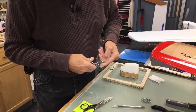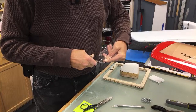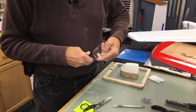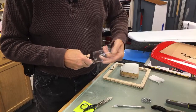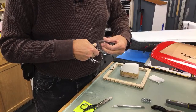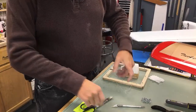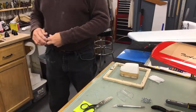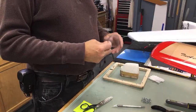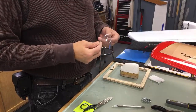Oh, yeah. That's why I couldn't believe those guys at Boeing couldn't pull that Horten 229 canopy. They wasted two big, thick pieces of half-inch thick Lexan, 4x8 sheets. You know, Boeing, money's no object. Sure, they've got a big giant autoclave there and all sorts of stuff. They pulled that piece, no frame. You can watch it on YouTube. They pulled it out of that autoclave on top of that plug and then tried to pat it down with oven mitts. Oven mitts, and you're going to get handprints in it and everything else. Believe me, if you've got a real good mold and oily fingers and you grab your mold like that, your fingerprint will show up right in your plastic.